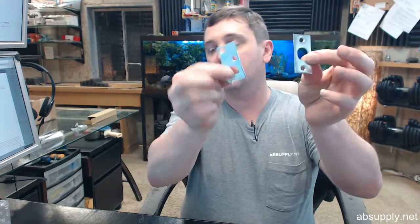And that's difficult because that drill bit, which needs to be 18-inch long, has a tendency to walk to find the less dense sort of material, because generally in an architectural door, you'll have laminated material, or you'll have a wood style either glued down to particle board, or it's not glued and it's floating, and that drill bit will just walk its way down, making it a challenge to drill it properly. So that's the three primary things that you have to be concerned with. And then of course just mortising for the strike and the guide is common as well. It does include screws, wood screws and metal screws.